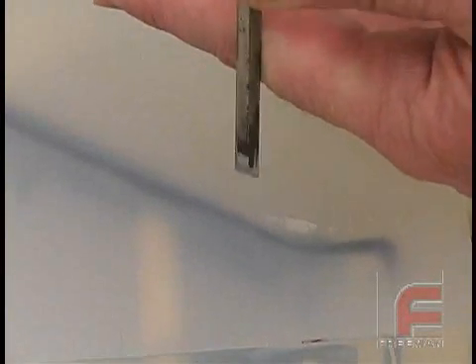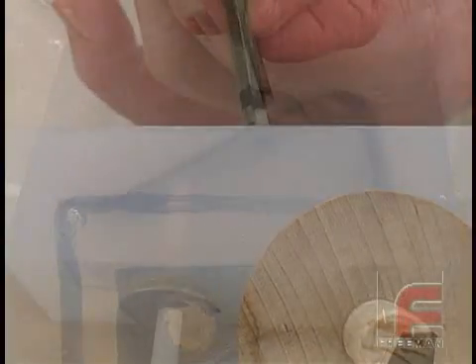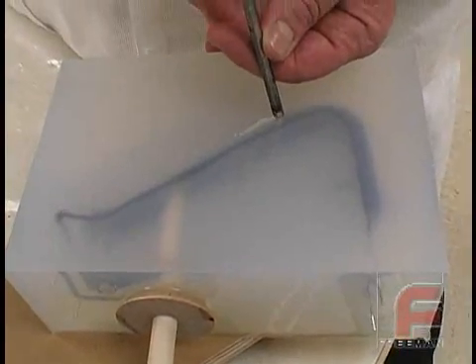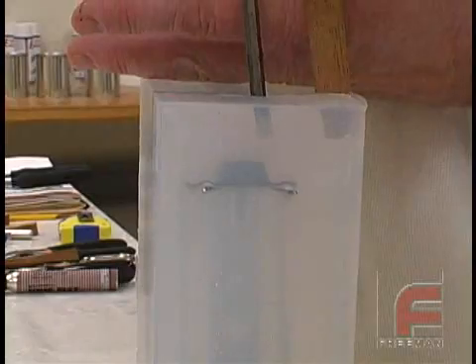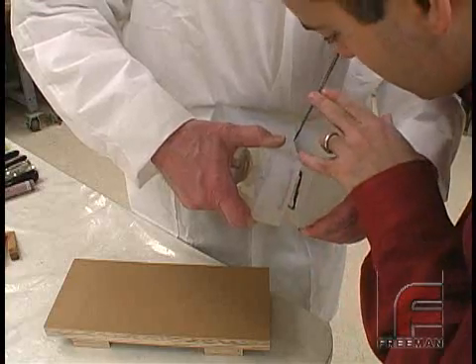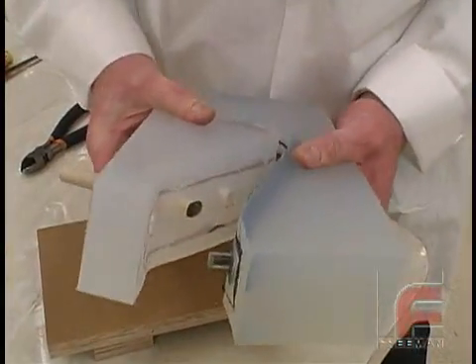Note that we aren't trying to cut all the way to the tape with our first pass, but rather we are planning on taking two passes with the gouge. This conservative approach not only makes it easier to cut, but it also establishes a more complex registration that will ensure proper alignment of the two mold halves later. Our first pass simply establishes the outside of our parting line. With the second pass, we place a wedge in this established parting line, which makes it easier to access and then cut the remaining rubber all the way to our clear tape. After the second pass, there are a few remaining small sections of rubber not completely cut through, and therefore keeping the two halves together. With a brief final pass with our gouge, our mold comes apart.